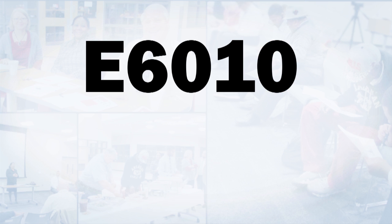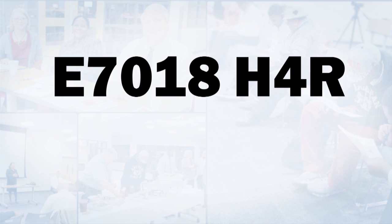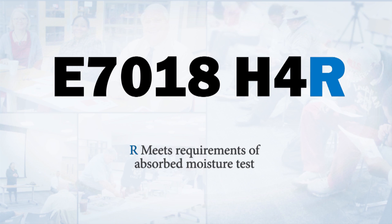You can also have an addition out to the end that can tell you a number of things. Some of it's for low alloy electrodes, telling you what other elements are alloyed into it, and some of it, for instance, on a 7018H4R, tells you that it's low hydrogen, and the R means it meets the reduced moisture requirements, so you can have it out of the oven longer without picking up moisture from the atmosphere.